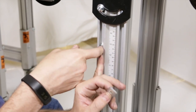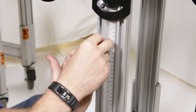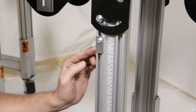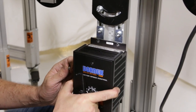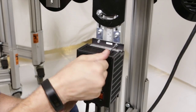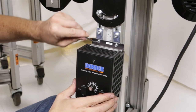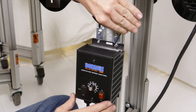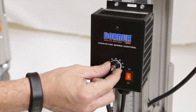To mount the controller, install the T-bars into the T-slot of the stand and attach the plates with screws. Attach the controller with two socket head screws and tighten. The conveyor is now ready to be plugged in and tested, ensuring smooth operation.